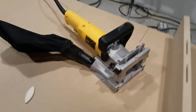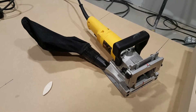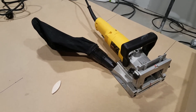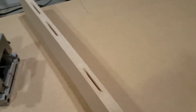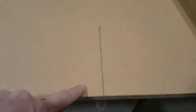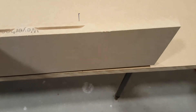What I'm going to do is use a biscuit joiner to help out. One of the benefits is it creates more surface area for gluing, but I'm more interested in using it for alignment when I glue and clamp. What a biscuit joiner does — for those of you who don't know — is it creates these little cutouts here. I've done a couple samples in this piece of scrap. You take one of these biscuits and put it in there, and you'll have another hole in the mating piece of wood. It'll fit nicely into that hole on the edge and give you a nice reference, holding it in place while you clamp it.